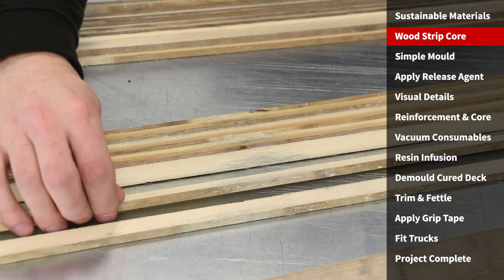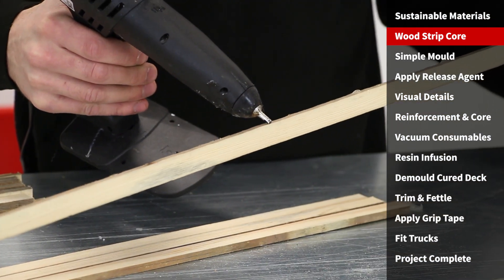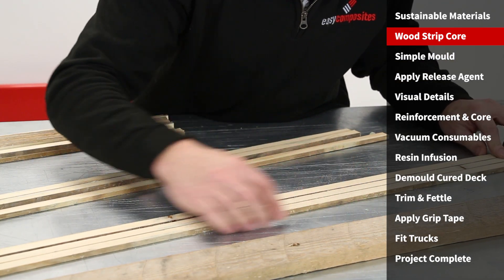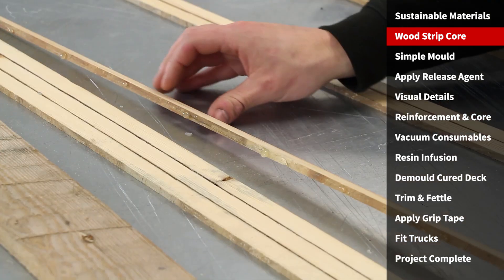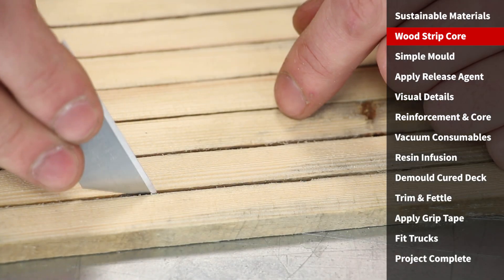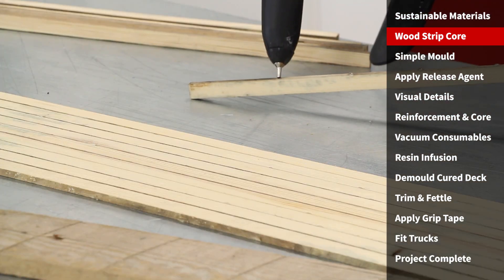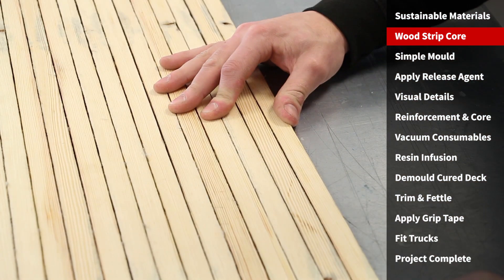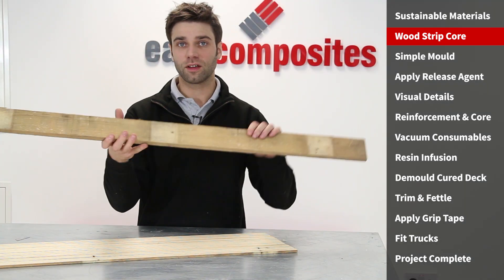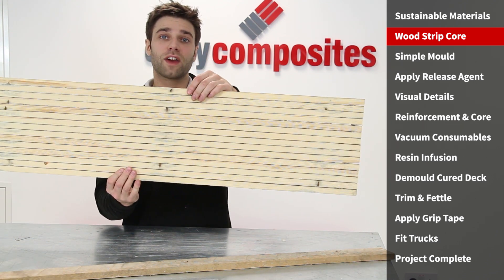The first thing I did was cut these strips of wood from shipping pallet on the table saw. These will stack to make a core very similar to that of a snowboard. By gluing the pieces together with dots of hot melt glue, I've left a gap between the pieces that will allow the resin to flow from one side to the other, which is necessary for resin infusion. Without the gap, the resin would only properly flow over the top side of the molding, leaving the mold face of the reinforcement still partially dry. So we've upcycled a piece of old pallet wood into a vertically laminated, infusion-ready longboard core.